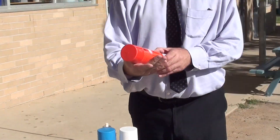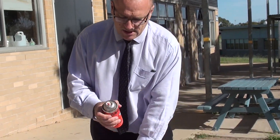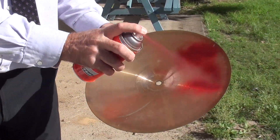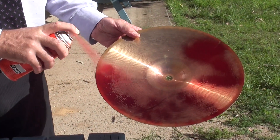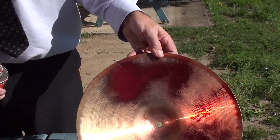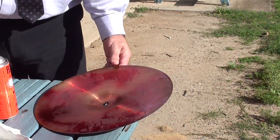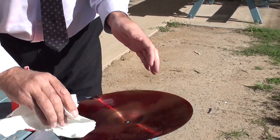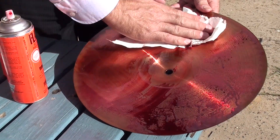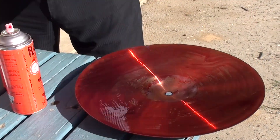Second step. You can see it here. This is the dye penetrant. This is an incredibly runny oil-based dye. You can see where the pre-cleaner — can you see where the oil was still on the sample? Some parts of it there's oil left behind, other parts it's gone. I'm just going to let that soak in.